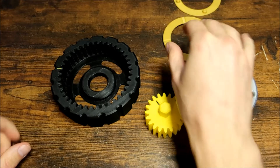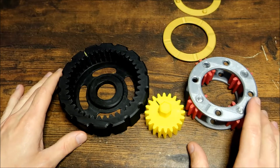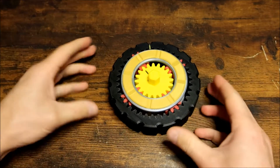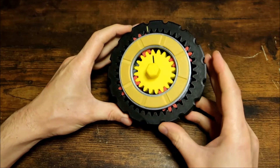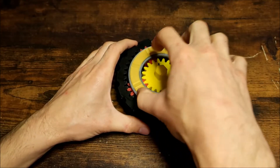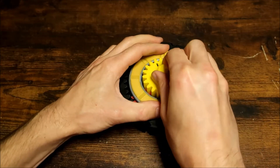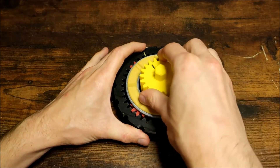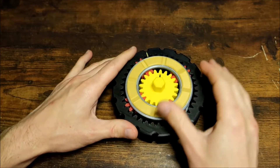What I'm going to do is put these pieces back together and look at how everything operates as a whole. Through the magic of video editing, we can see that everything is put back together instantaneously. Now in reality, if I had an actual planetary gear set, I would do that real time — everything basically just slides in and out fairly easily. Sometimes it can be a pain to get the sun gear to line up with the pinion gears, especially if they're helical, which tends to be a bit finicky.